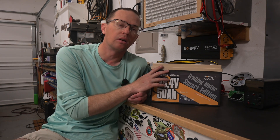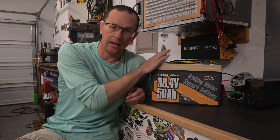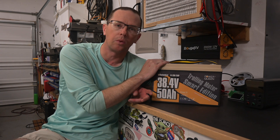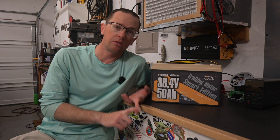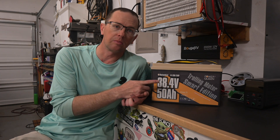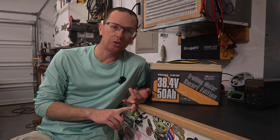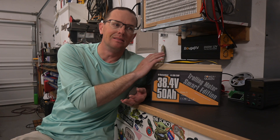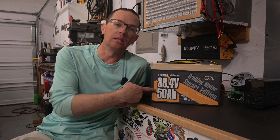I've done a video comparing the three-battery setup versus a single battery setup — I'll link it up here if you're interested. I run a 36 volt battery, and honestly this is the way a lot of boats are starting to go — it's just a more efficient way to do it. The features include the Bluetooth app, low temperature charge protection so that if you put it on a charger when the battery is frozen it protects itself from lithium plating, which affects long-term capacity. It's also got overcurrent discharge protection, low voltage, high voltage, and temperature range protections — literally everything you could put into one of these batteries from a feature standpoint.